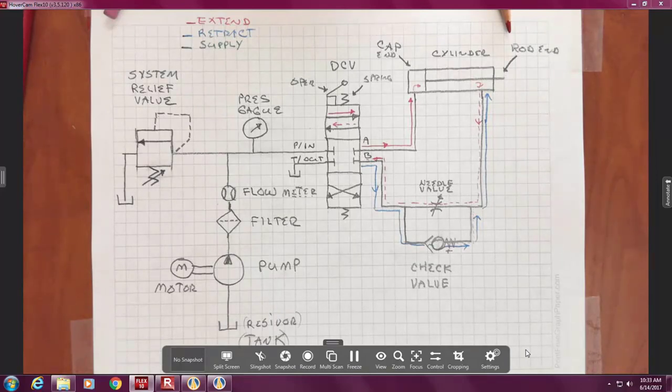So I mentioned to some that we have to get rid of the common thoughts people have been told. Solenoid is a relay really in a car, not a solenoid starter. Electricity follows the path of least resistance. That's a fib. When you see the squirrel being fried, touch that power line, there's plenty of energy for you. It follows all paths. What that phrase means is where there's the least resistance, the majority of the river will flow, but if you add a little path, it'll go down there as well. So I'm not saying it's impossible that oil won't go through the needle valve. It depends on how much it's closed or open in this blue direction. But certainly the majority will be going through the check valve.